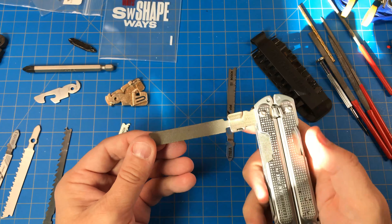You can easily take this out — you just kind of unlock it, take it to this position, and then push that. These two pieces kind of stick together at a 90-degree angle. I have a little pin that keeps them stuck together. So now I can take something like a much thinner wood blade here, one millimeter thick, put that in there — locked in. This has a little bit of wobble, much less than if you put a T-shank into a Leatherman Surge; those have so much wobble that people sell shims to fix those. So this is enough that it's completely usable.